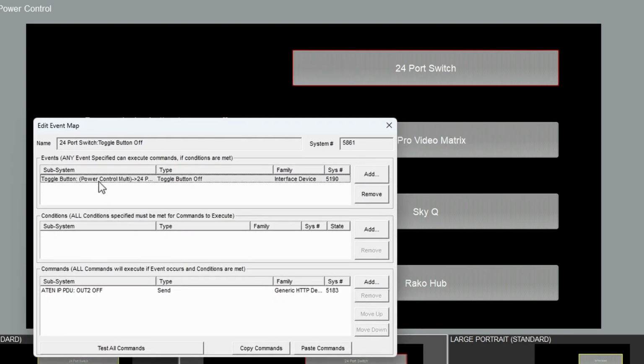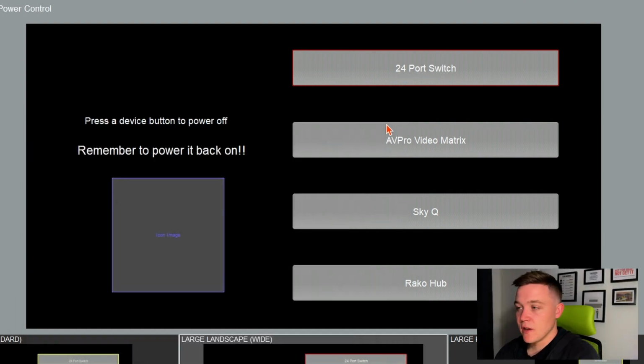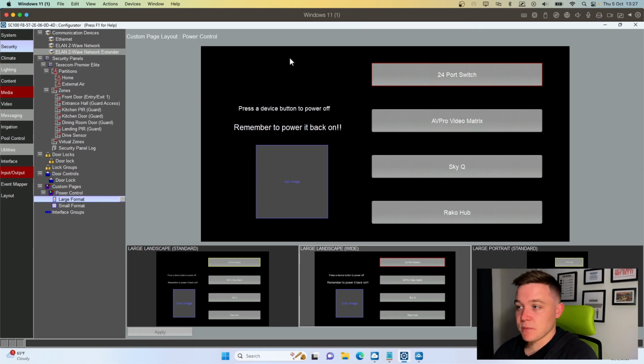And this has worked great for me for a long time now, and other projects that have got IP PDU spec'd in them. But this is a manual process, and this is also a one-way driver, so you don't get any feedback on the status of the outlets. And it could take a little bit of time creating commands for each outlet, so on or off. So you could create the driver and export it and then reuse it later on another project.